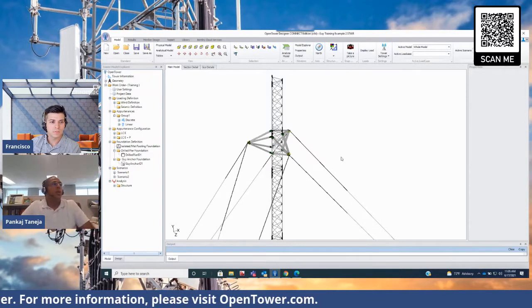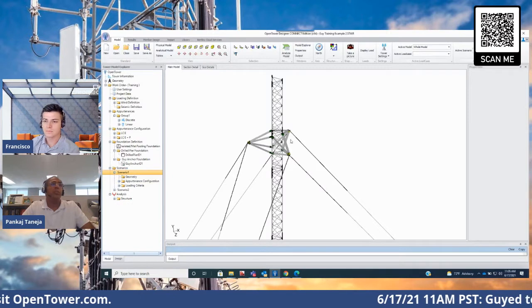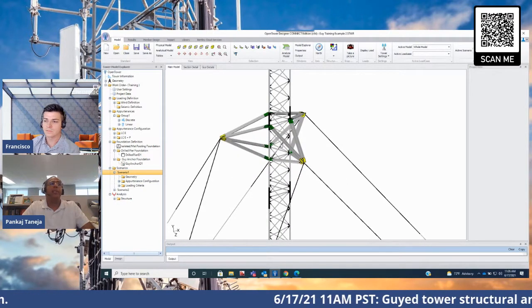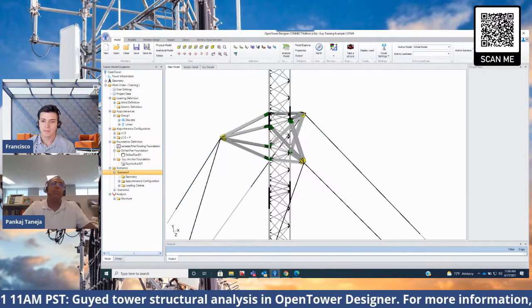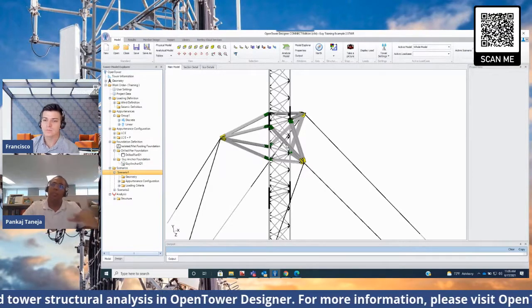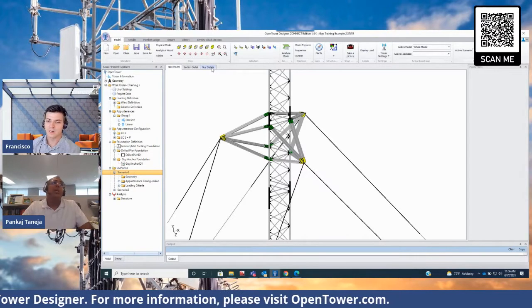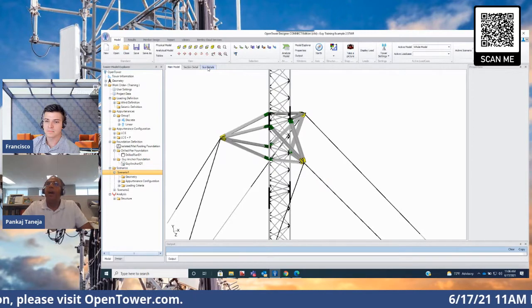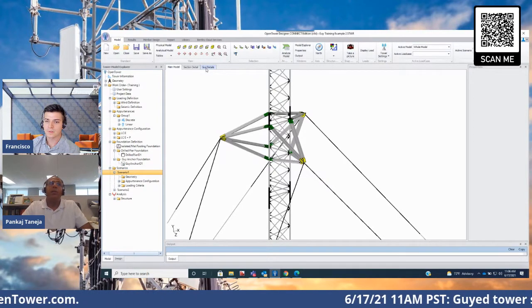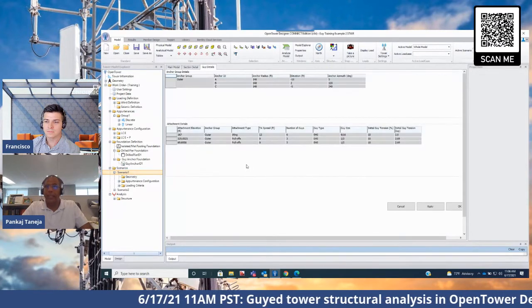Okay, that's very important because stiffness is important as well as the wind load. If you consider that whole area and apply it at the center, that's a different concept than applying the wind load on each member, each discrete member, and letting the forces travel to the structure the way they should. That's truer analysis rather than a simplification. Assumptions are easy to make, but if we don't know how the assumptions are transferring the forces to the structure, that is how much risk we are taking.